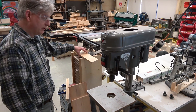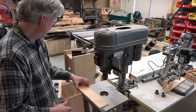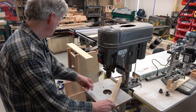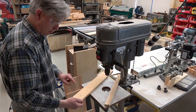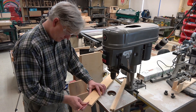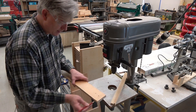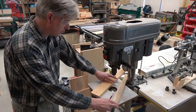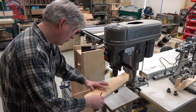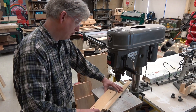If I'm cutting a long piece of wood, when the drill breaks through, I know that's going to spin. So I clamp the fence on to help me locate my work. If I wanted to drill a couple of holes, I could set this up so that the drill would be out of the way. There we go — now it can't move.